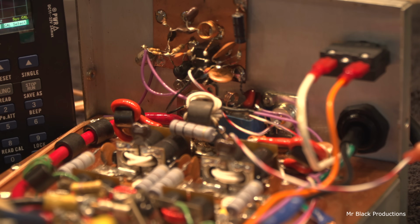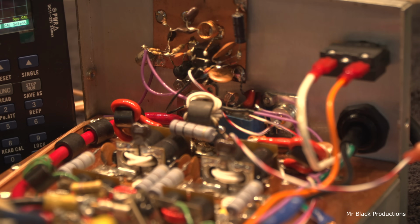So first I thought they might have had too high of a capacitance on the disc capacitor back here, stuffed behind a relay. No, it's the right capacitance level. That happens. It's happened to me. You reach into a drawer full of capacitors and you think the drawer's got a bunch of 10 pF caps in it, and maybe a 100 sneaks in there, or maybe a 75 by chance. So I pulled it out and verified that, and no, that's not the issue.